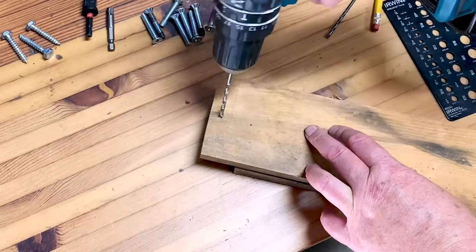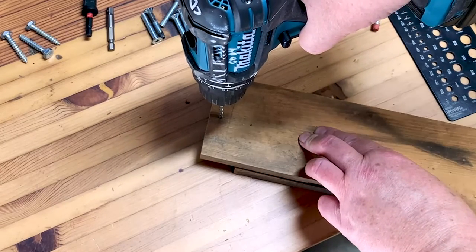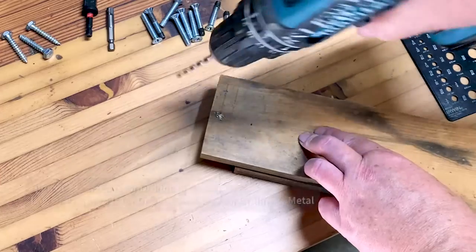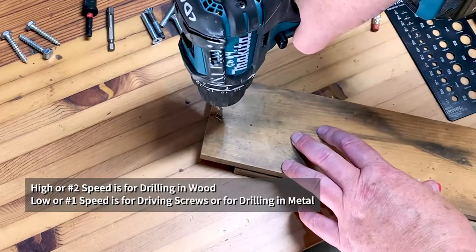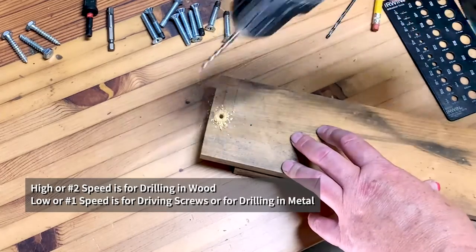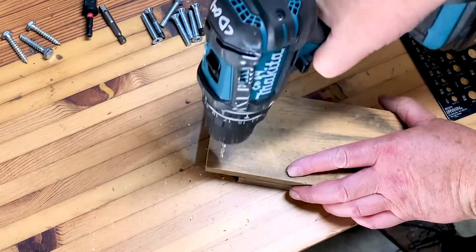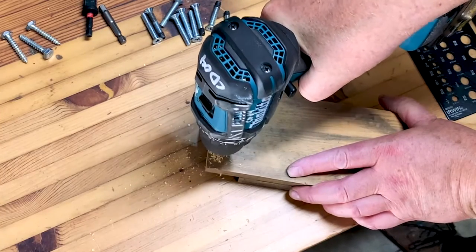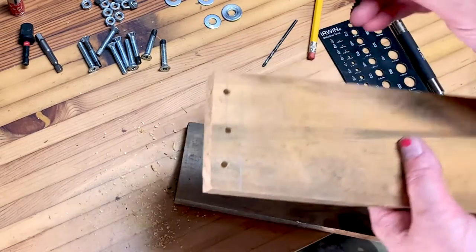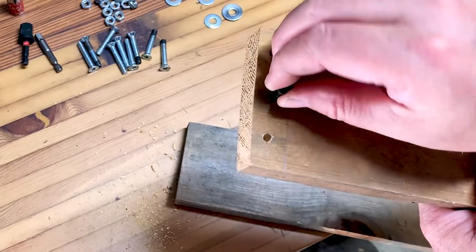You need to keep the drill straight — you don't want to be going left and right. If you do that, especially if you're using that sixteenth-inch bit, if you get partway through and shift slightly, you're going to break that bit all the time. I can go up to number two gear for drilling. We drill the other two holes. Now if we've drilled them right, our drywall screw should slide right in through there, and that works real well.